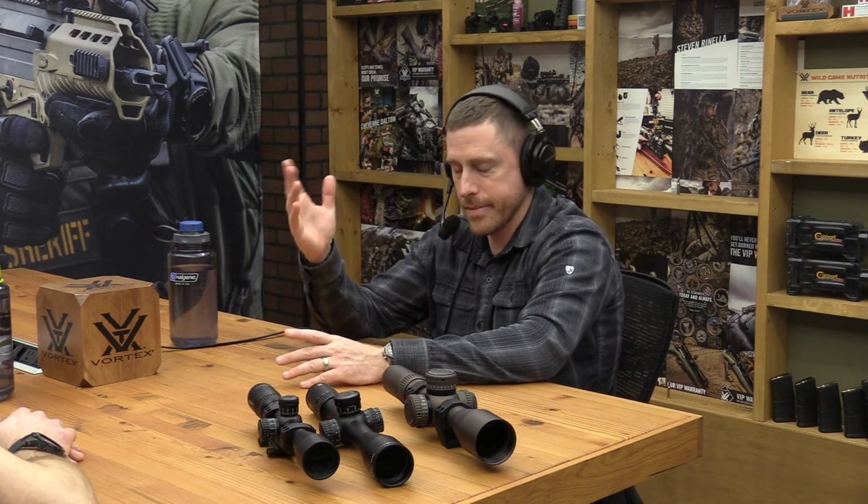So if you increase the field of view, for example, that might affect how much travel you have in the same tube size. Does that mean maybe your erector unit inside just got bigger so it has less room around it to move? Yeah, it can, especially for a given focal length. Your image physically gets bigger to get that bigger field of view, everything else being equal, and you've got to capture that image, which means your mechanics got bigger, which means you have less space for travel.